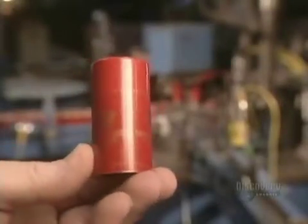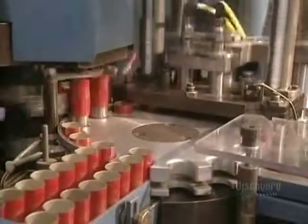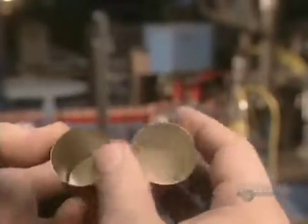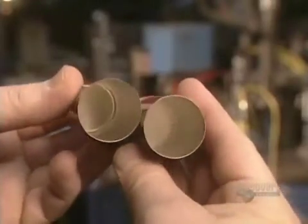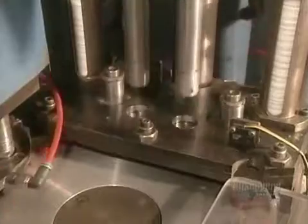All that's required now is to form the cap and make the cut. The profiling and jointing machine makes the cuts and reliefs on 200 caps per minute — machining the cap takes but a fraction of a second. They sometimes have to assure the water tightness of a container such as a wine bottle. For this, a polypropylene liner is inserted which hermetically seals the container. A check is carried out under a light to verify whether the cut has been properly made and the ridges well formed.